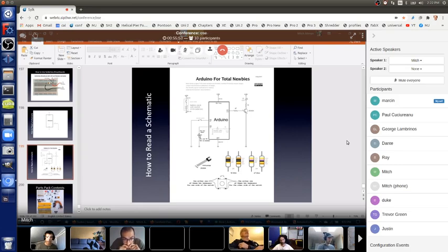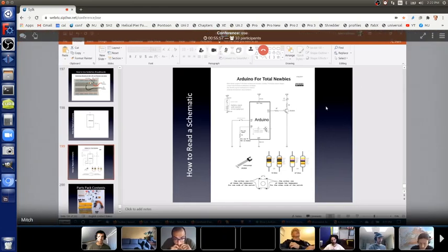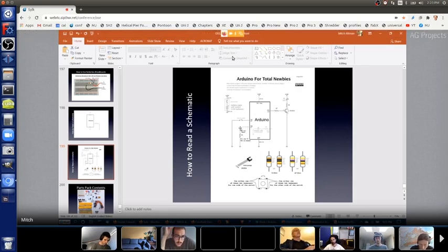Let's look at this part of the circuit first. So again, inside, there's the visible LED and the built-in resistor to keep the magic smoke from going away, going from pin 13 to ground. That's built into the Arduino. Nothing coming out of the Arduino on pin 13. But here is pin D5. So at the pin 5 hole, we need a wire coming out to go to the top of a 1K resistor. The bottom of the 1K resistor has a wire going down to this symbol. What's that again? Ground. Yeah, so we have to connect it to a ground hole of the Arduino board, somehow connected to the black wire of our power supply.